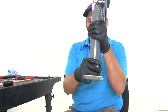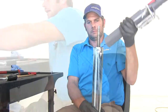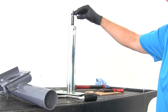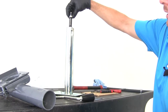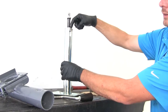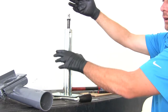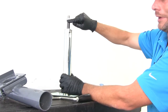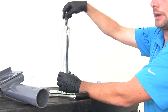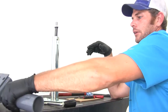Now it's time to pull on the base, or we can just lift up on the outer tube. Inside we've got our bearing and our other support washer — it goes right down on top of the screw, and our bearing fits on there to offer very low friction operation. You'll see the screw just threads down into that base plate, so as we turn it, this expands running the jack down; go the other way and it brings our jack back up. This screw is very hard to damage, so if your jack isn't operating properly, it probably has to do with this bushing creating friction or the gears not meshing together anymore.